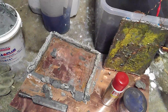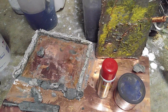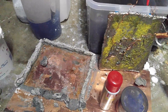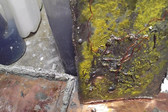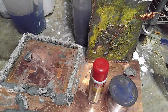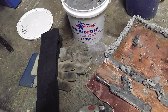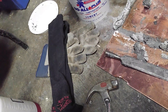Once I got it poured, I found that rather than trying to drill into it to put electrodes in, I stick copper in it and embed it in the bismuth itself. Those are just old springs — it helps to hammer them out first if you're going to use springs or coils.